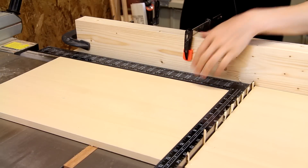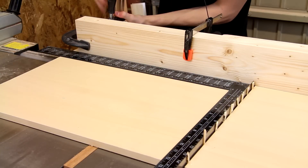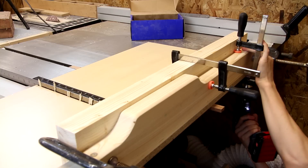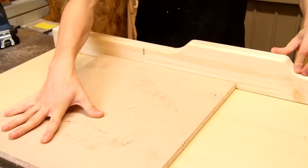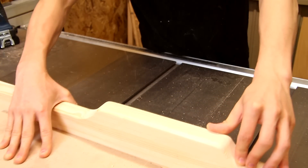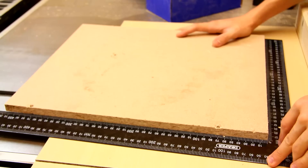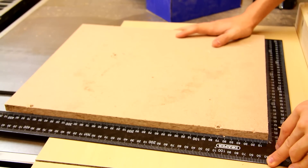I'm checking to make sure the fence is still in square, and now I can drive a final screw at the far end of the fence. I'm performing a test cut to make sure the sled produces adequate results — wide boards such as this will help identify any errors, and of course if the results aren't adequate you can simply remove the second two screws and try again. That seems to be pretty good; I'm certainly happy to leave it at that.